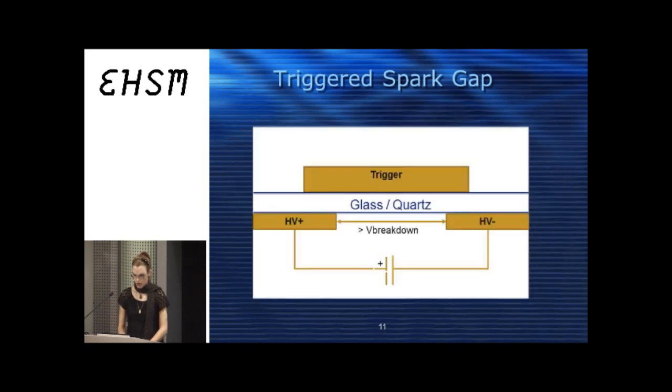It's characterized like a MOSFET — specifically a silicon-on-insulator MOSFET. You have an insulator on which the two electrodes are placed: one at very high potential, the other at very low potential. You want to space the two so the gap is just greater than the breakdown voltage. In practice, you want to add margin because humidity in the air or ionizing events such as a flash from other cameras can ionize the air or provide conductivity along the glass surface so the capacitor will discharge prematurely.